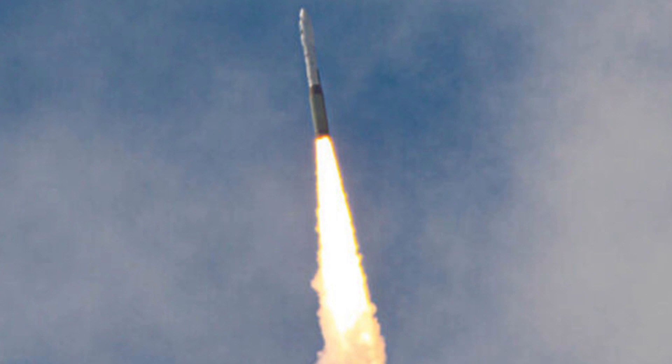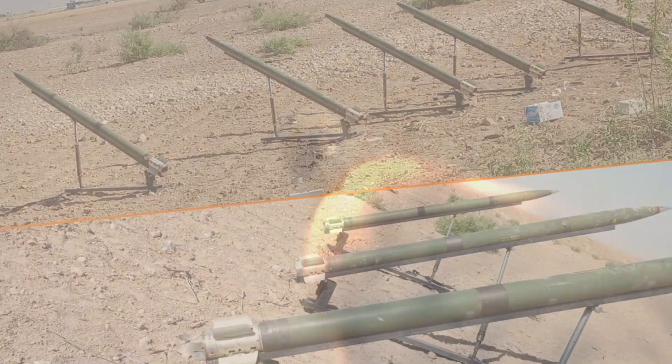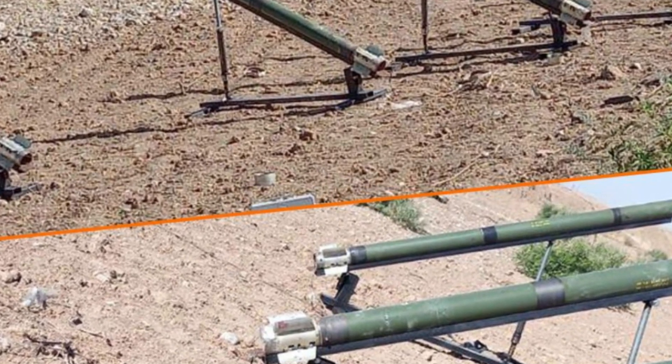The nozzle is not slanted, unlike many other rockets. That is, the rocket does not rotate around its longitudinal axis during flight. While this greatly reduces accuracy, it greatly simplifies manufacturing and the firing system required.